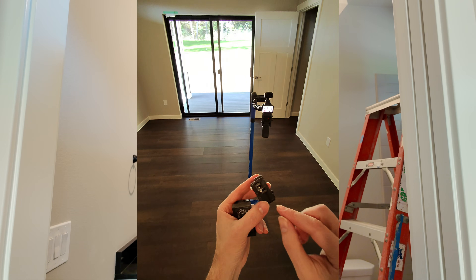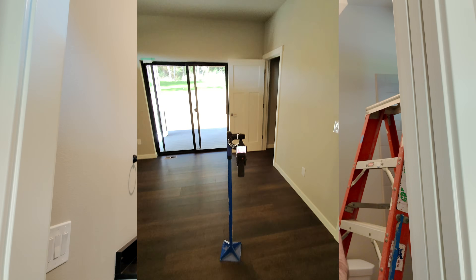This sensor is really cool — it's kind of like a mini psychrometric chart. It pays attention to the temperature and the grains of moisture, so it doesn't actually have to have condensation form on it in order to trip. 80% is definitely going to be triggered by the steam you get from a shower. On a really hot, humid day, if you had it set at a lower percentage, it might kick on when you don't want it to.